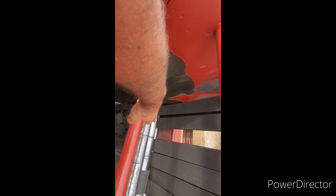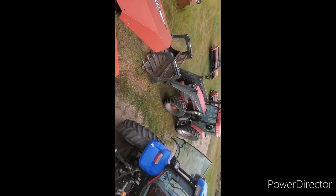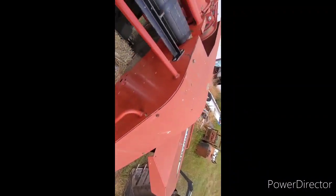So this big arm right from top all the way down to that bottom roller right there, which isn't even at the bottom, but just at the bottom of that roll. Let me think here. That's the bottom pressure pickup roll is what that's called right there. So that one's good. Top pressure pickup roll is this one, the next one up right there. The bearing on that side is kaput. So yeah, not a good thing to have happen at this point by any means. So throw the gloves down. Now I'm gonna crawl down.